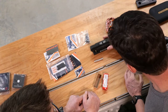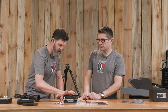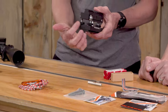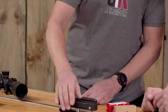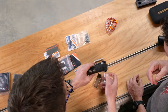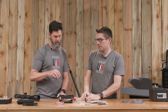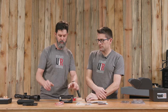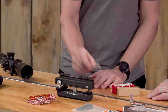What Short Action Customs has done is machined this so all surfaces are parallel and level. The feet are adjustable in two directions — this almost looks like a tie rod end, with a bushing so it can tilt and articulate while staying perfectly solid. If you had this bolted down on a table that wasn't flat, you can adjust it to get level on all axes.